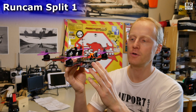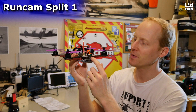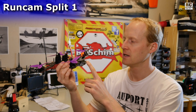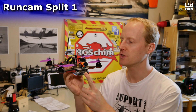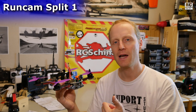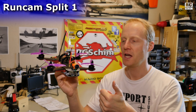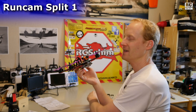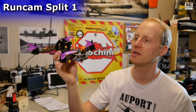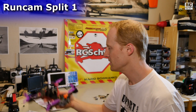This is the Runcam Split, the first edition, and it had a few downsides. It had a storage card slot that nobody liked because it was so flimsy. You couldn't really access the WiFi dongle nice and easy. It only would take 5V, which could be dangerous. The lens that it came with was not so good. But other than that, it was very lightweight, so it helped me on this Vortex here to get it even lighter — removing the needed weight for an HD cam and just fly longer. To get nice footage though, I had to use an ND filter to get it jello-free. Jello is always an issue on those CMOS cams, especially if you have vibrations on your copter, which almost anybody has. So that was the Split one.